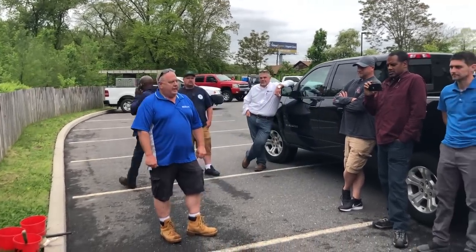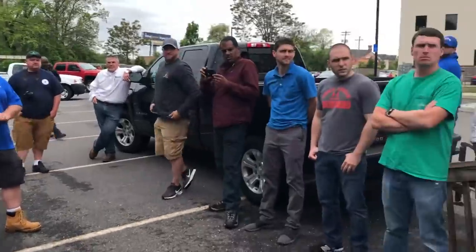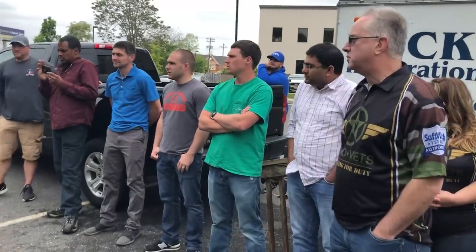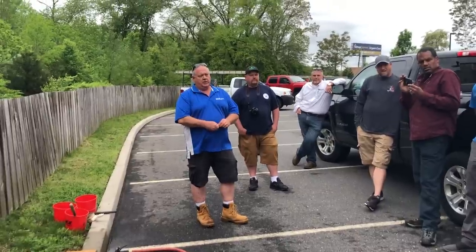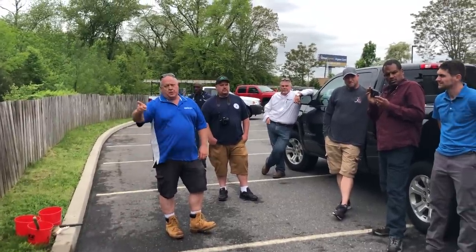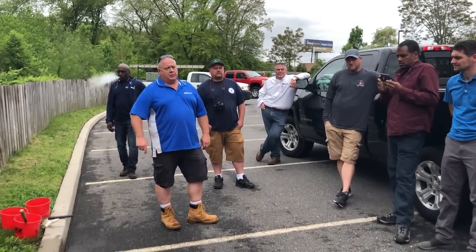Any questions on the demo? For the composite decks, the same method? You could use the bleach and then the brightener. Yes, absolutely. Two-step, the same way. You could use SH or sodium percarbonate on the old style, with the oxalic, right? The oxalic will do just what it did.